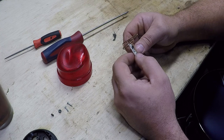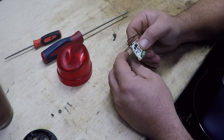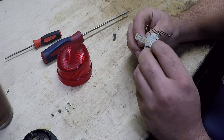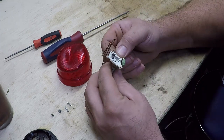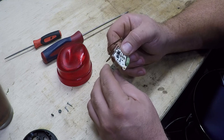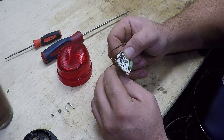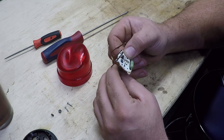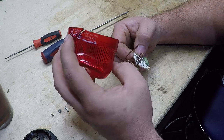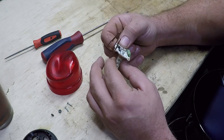The solder on the LED strip is giving me fits. I'm going to gently wiggle this and see if I can go ahead and just take that LED strip out — make sure it's the same on both sides. Okay, so we put it back in there backwards. I'm trying to just break this solder joint right here. I'll take the strip out and then see if I can get this board back where it belongs. And then we will desolder the solder off that LED strip and put it back in.